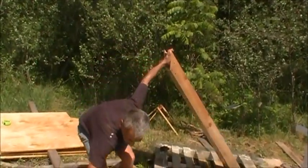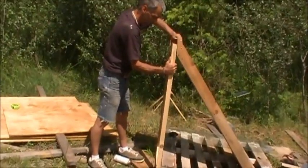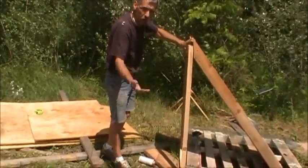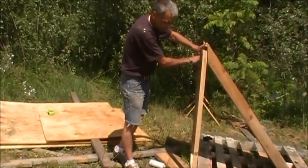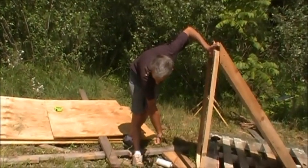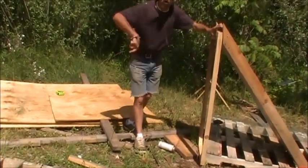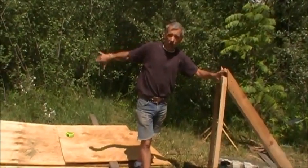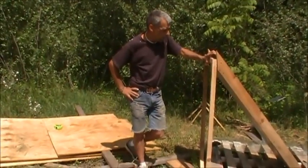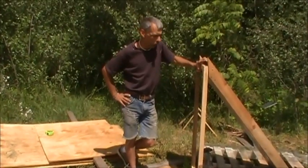The end that he has right there attaches to a box — a high box — which is the start of what is here. This will be about two feet wide, with drawers and shelves for your drying racks. The hot air will come in at the top, pull down through, and the outlet for the air will be on the opposite wall at the bottom. The air will actually come through the wall cavity and out the other end — really great idea. We're not going to use a stove pipe; the wall cavity can be used as an airflow channel.